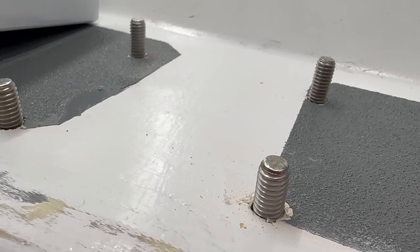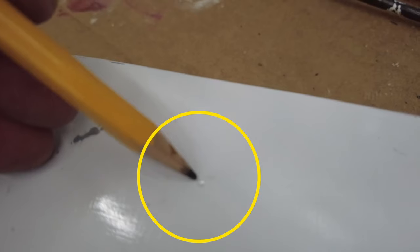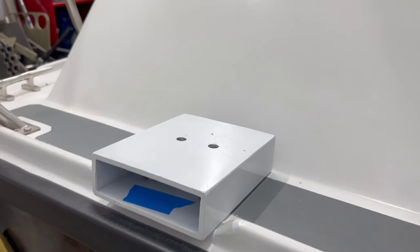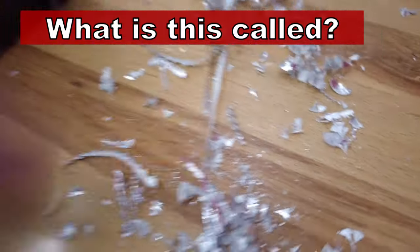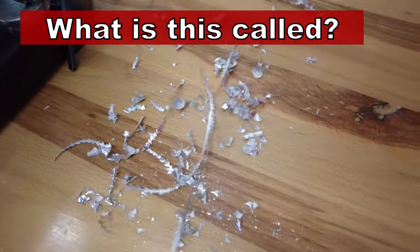Here's an example. I've drilled the holes through the deck — this is where the bolts are going to come up through the deck. I remove the bolts, set the base on top of the deck, and then very gently score the base, maybe using a drill bit, just so I can see where the holes would be drilled. You can just barely see the markings. This is what I'll use when I put it on the drill press. Now, if you were super precise, you could try and measure everything. The reality is something's always going to be off because none of the surfaces are perfect and all of the material is different. Here's a great question — it's something you're not going to see on some reality TV boat restoration channel. When you drill something and little pieces of metal come off, what do you call this stuff?